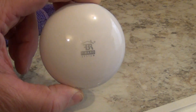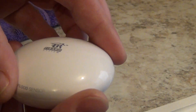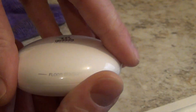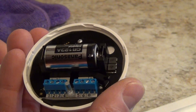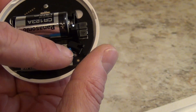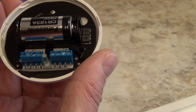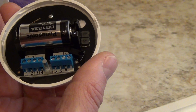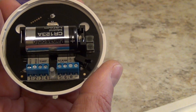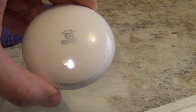I want to give you a close-up of the FIBARO sensor — you can see how small it is. There are the pins on the bottom. To open it, you just screw the two halves apart. There's a nice big CR123A battery so it should last quite a while. From what it looks like on the inside, you can run external power out of this unit, but you'd have to make some notches in the cover to get the power wires out — you can even have another sensor come off of this unit. Maybe if you use an external sensor, the onboard one is disabled; I'm not 100% sure, but I have seen some videos of people messing with that. Then you just line it back up in the right spot, twist it, and you'll see the light come on once it's closed.